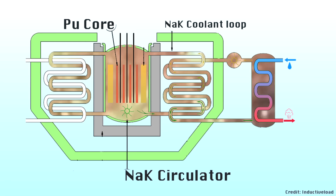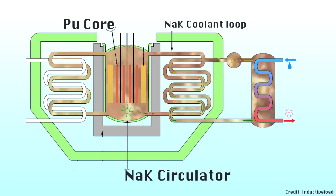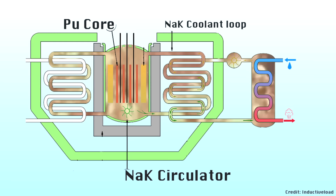More than 35 years ago, there was a lot of research here on NaK. They used to use it as a coolant. So it's a liquid so it can be flowed around quite easily, but it's a metal so it's got really excellent thermal conductivity. So this liquid metal was a coolant, particularly used in the nuclear industry.